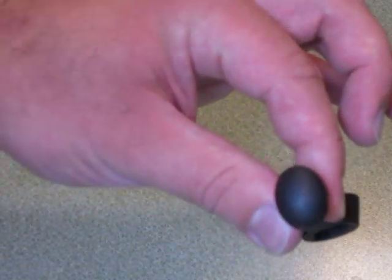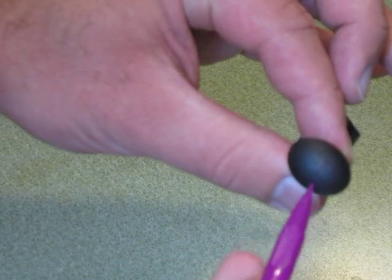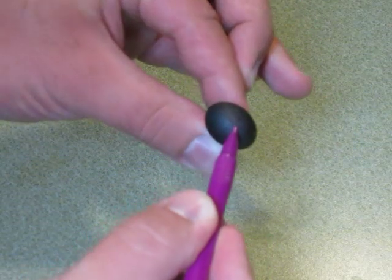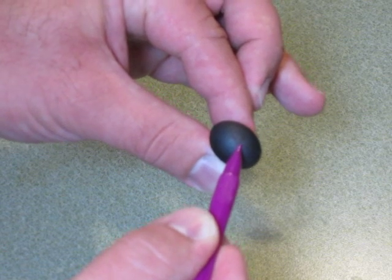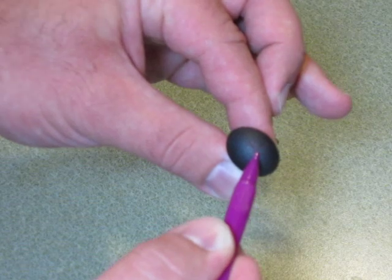Now I don't know how well it's going to show up, but I already have made a permanent marker line or cross where I'm going to be drilling and tapping for a 10-32 machine screw. This is going to give the knob a bit more backbone and allow it to use the full leverage of the entire length of the knob without putting too much stress on the epoxy.